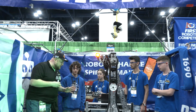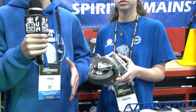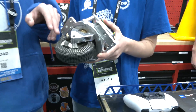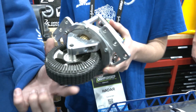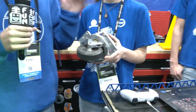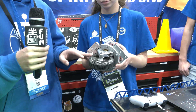Let's start off talking about your swerve drive. Talk to me about what's gone into it and any custom features. So we use our own custom swerve drive, which is different from most swerve drives. One major element is that the bevel gear is directly connected — it's the same part as the wheel. We made it a custom CNC-machined wheel. One thing we really thought was important in this robot was the center of gravity, so our swerve drive sits a bit higher than normal relative to the chassis.